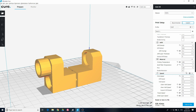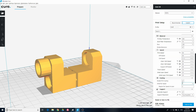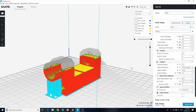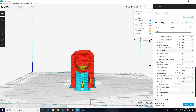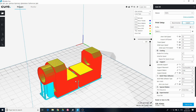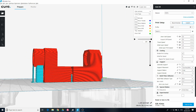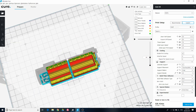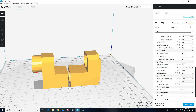The box doesn't actually tell me about the bed temperature. Normally I print at 60 but I'll try 70°C and see how that goes — I don't have an enclosure so it's quite cool here. Print speed is 30, wall speed 30, travel speed 70, initial layer speed 10. I am using support. The only overhang I'm worried about is one area — there might be some strings but the switch goes in there so it doesn't matter.